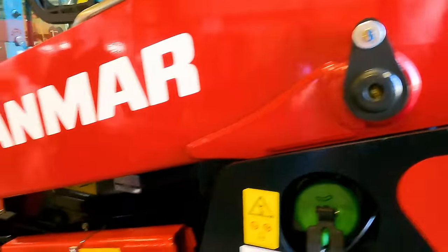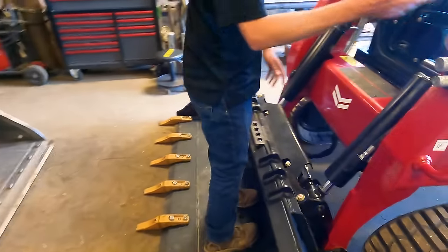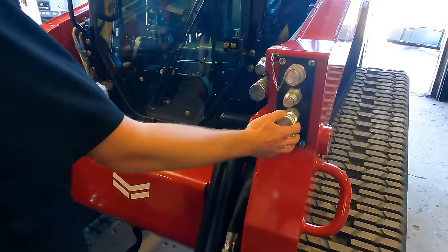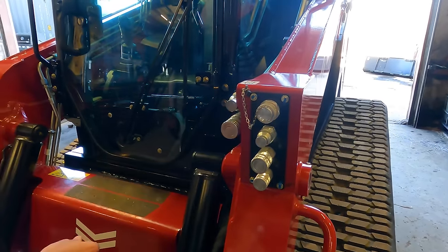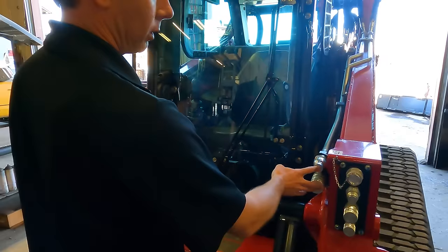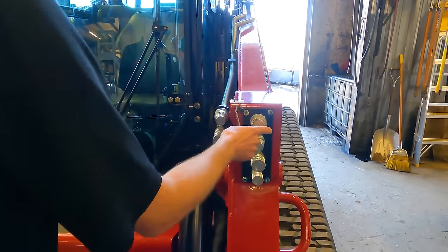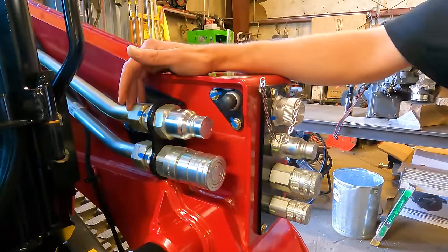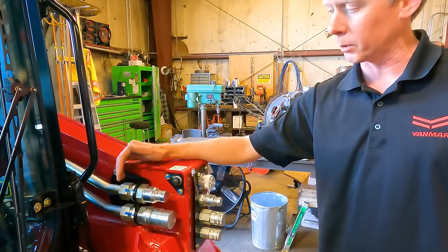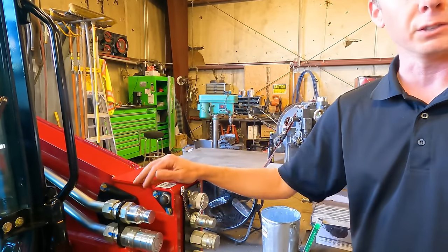You've got your safety brace when arms are up, another tie-down location, and your quick coupler. All standard-flow auxiliary hydraulics are located here; this is a case drain for running a mulching head or similar. Your high-flow auxiliaries are here, your pin connection for electronics is here, and there's also a pressure release button — so if you accidentally energized your auxiliary hydraulics and can't push in your quick couplers, you engage this button to backflow the hydraulics and relieve pressure off the fittings.